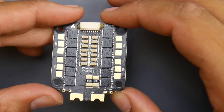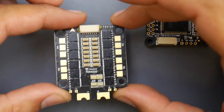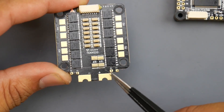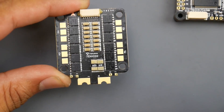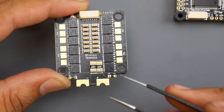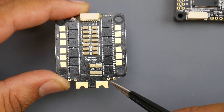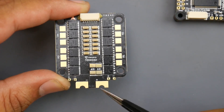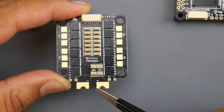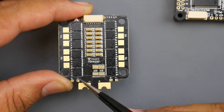Take something into consideration: this stack says it has an 8-volt regulator, but the 8-volt regulator is not on the ESC. You might mistake these for the 8-volt regulators, but they're not — they're just VCC and ground, so it is battery voltage here. If you needed something that takes battery voltage, you can easily grab some from here. I really like that. If you wanted to give a VTX some battery voltage, you can just go here instead of risking damaging something or overheating the board. Those are battery voltage pads — whatever this is getting, this is what will be output through here.